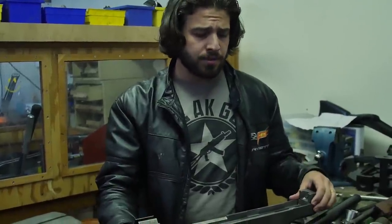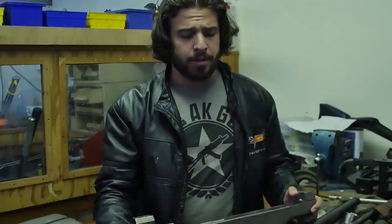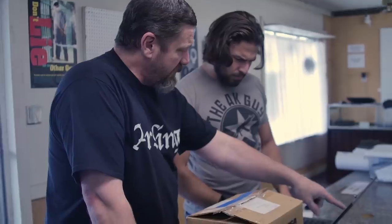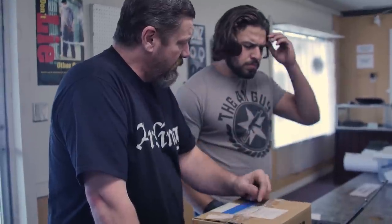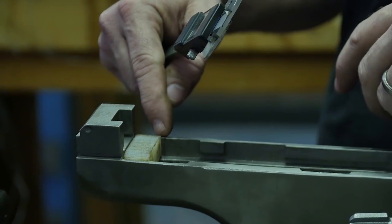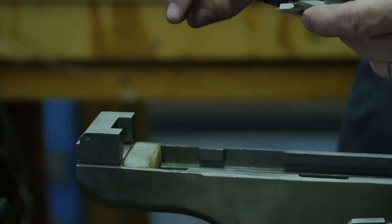This is what we came up with. We finally got the receiver back and the bolt carrier back, which are the two pieces we were waiting for. But I noticed it last night and we definitely confirmed it today - we started running measurements on it. The rails are very warped. The gap between the buffer and the receiver side is 179 thousandths. That should be a fitted piece - you should have to kind of push that in there.